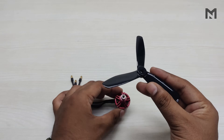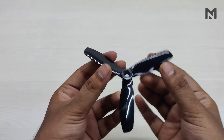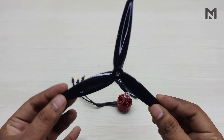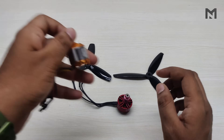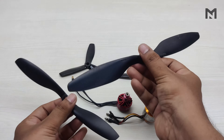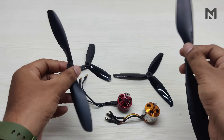I'll be testing it with a 5-inch propeller, which is recommended in its datasheet. Though it's not recommended, I will also be testing it with a 6-inch propeller. And since I am doing a thrust test on the motor, I'll also be testing my old 1000kV motor — with a 10-inch propeller and an 8-inch propeller.